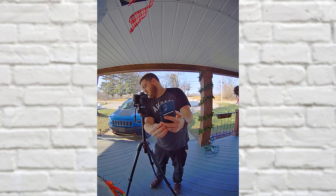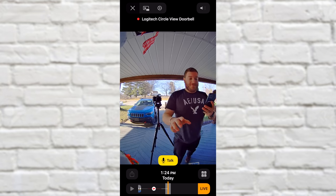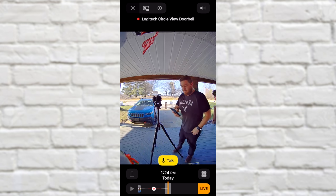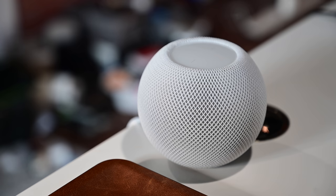Here's some sample footage right from the sensor. This doorbell has HDR video, which helps a lot when the scene is backlit. It has a 3-by-4 portrait ratio for head-to-toe coverage, as Logitech likes to say, and a 5-megapixel sensor giving you 1200 by 1600 HDR video. The video is fairly crisp and better than some other doorbells we've seen, though it isn't perfect. Logitech uses video analysis rather than a PIR sensor to detect motion, and we found it's been a bit over-sensitive, generating more notifications than we'd like. With the head-to-toe view, a package at my feet is barely visible at about two feet away, and when it's on the mat you can't see it at all.